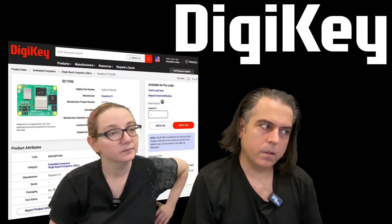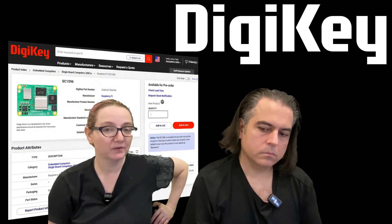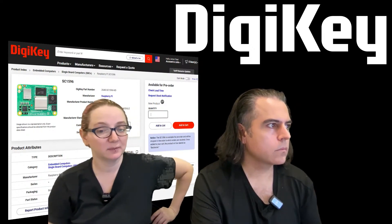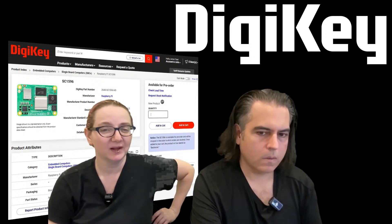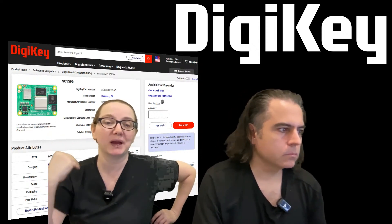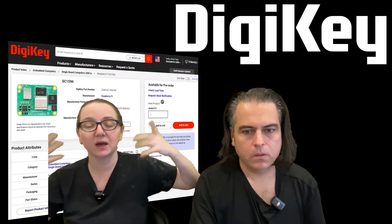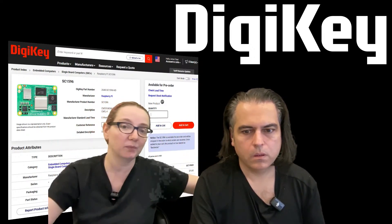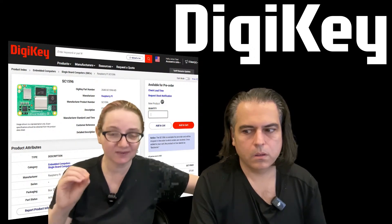One question related to this: are the CM4 carrier boards compatible with the CM5? For the most part, yes. The only difference is the USB ports are 3.0, not 2.0. The Panora board, which Timon designed for the CM4, is compatible with the CM5. If you have something that's CM4, you can just plug in a CM5 and you're good to go. But if you have something designed for a CM5 and depend on PCIe or USB 3.0, you may not be able to go back to the CM4. The pinout is the same but the capabilities are different, so think about whether you want two versions of your product — one with higher processing for AI capabilities, one that's less expensive.